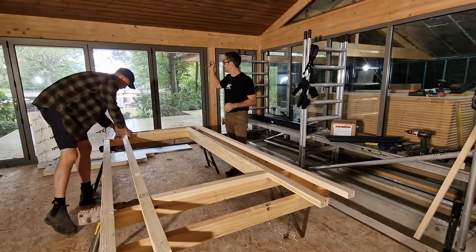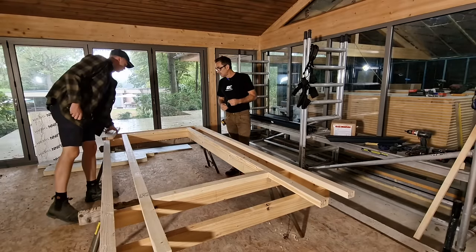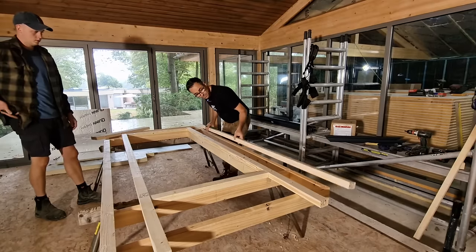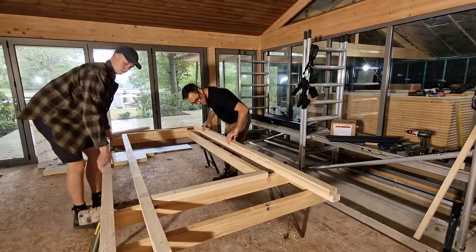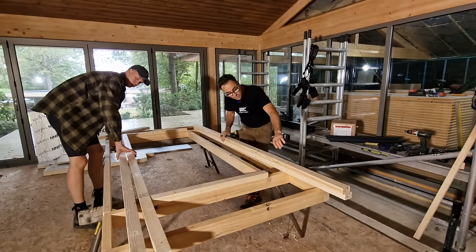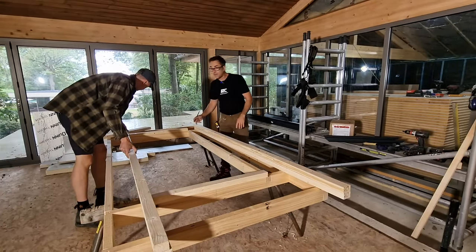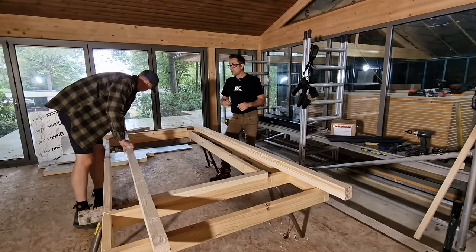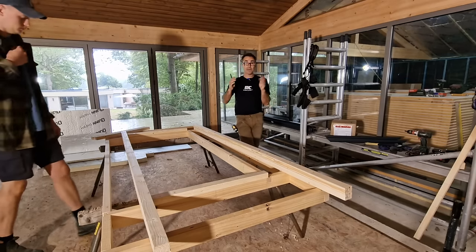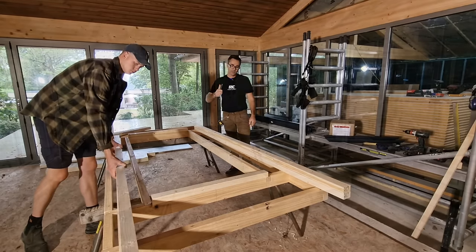There's no work to do on the day, which means when it's raining we're not worried about having the roof open. So we'll break these down as a pair, making sure they sit nicely on the bench so when we put them together they'll be nice as well — matching up the timber to suit the timber. We'll get those cut down first. Then we need to get some OSB ripped down to 208 millimeters to keep it exactly the same height. We'll screw it all together, put it as a whole, square it up — jobs are good.